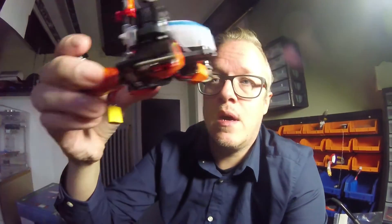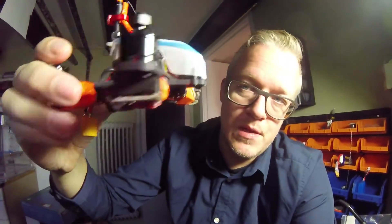Sorry for not making a video for so long. I hope you enjoyed this, and I'm looking forward to making the Atom V2 comparison. In the meantime, if you know how to build a quad — this frame, this layout, these motors — just do it. Put a Cleanflight or KISS board in there. Don't wait for the Atom V2. The only things to consider are placing the ESCs underneath the arms, and ditching the OSD because there's not enough space for it. I have my TBS Unify 800mW VTX and my micro USB receiver in here, and still the whole frame is raised up. You're not going to have space for an OSD unless you make space for it. I don't need one — I know my settings, and the rest is just gravy.